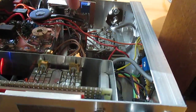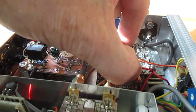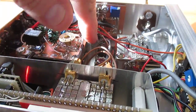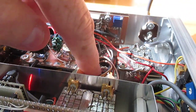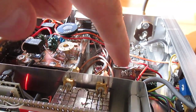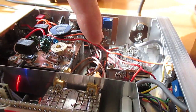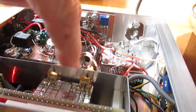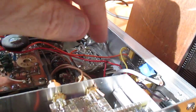I have my TIA amplifiers — there's the first one coming in, this bi-directional one, and then I have two more underneath it with my homebrew double balanced mixers and then a crystal filter running at 4.975 MHz. That comes out of this product detector here, becomes audio, and goes up to my audio amplifiers.